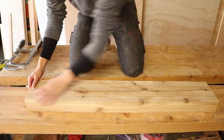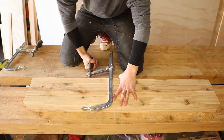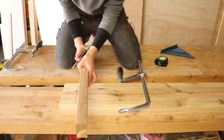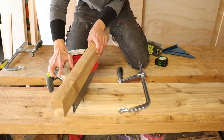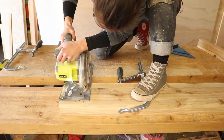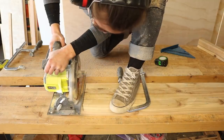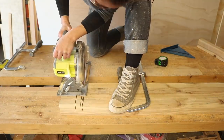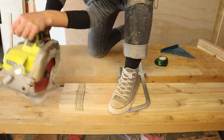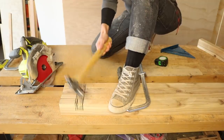I clamped all the pieces together so that when I cut the grooves that the shelves would fit into, they would all be in alignment. I left 3 inches at the bottom for feet and used a shelf piece to measure the width and depth of my saw blade. I made two slow careful cuts along each of the outer lines and then ran my saw through the center a few more times to remove the waste. I used a hammer to break up the smaller pieces — and as you can see, I was very careful and precise and didn't hit the legs at all.